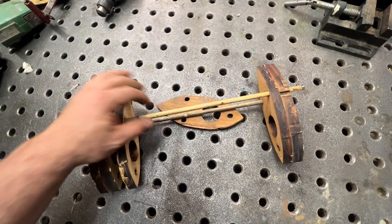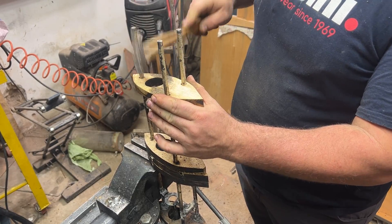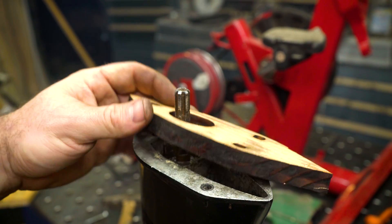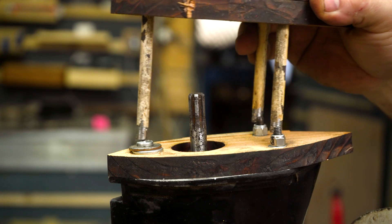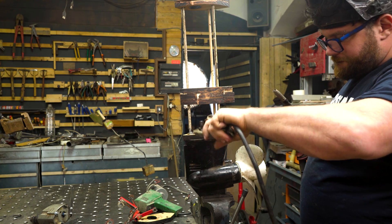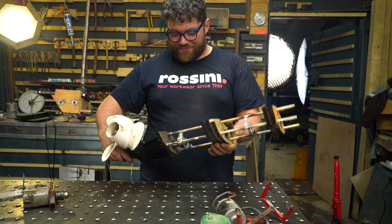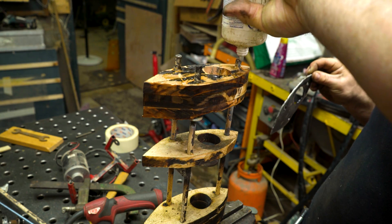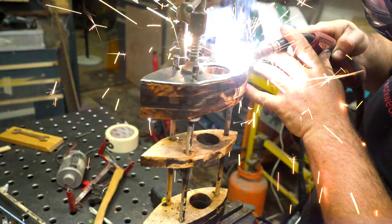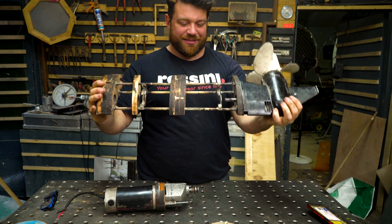I want all the parts as light as possible, so I'm using three strong stainless steel shafts to connect everything, with screws on the bottom of the engine that I can weld together later. If I need to dismantle it I can use an angle grinder, but I'm pretty sure I won't need to. The foot pedal area is filled with marine grease so no rust forms, but the top will get rusty, so it's important to keep the motor and drill section always dry. I can weld a metal plate for separation, and it's important to add water near wood when welding so it doesn't catch fire.